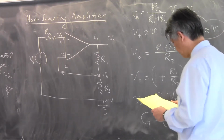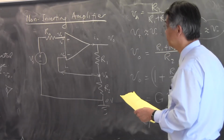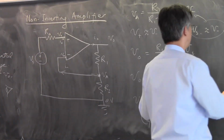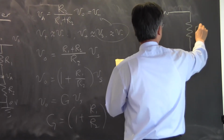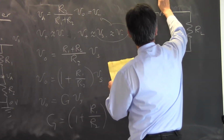And of course, as I said before, op-amps can be used for buffering. When you use the op-amp for buffering, it protects your source, source resistance and voltage source from external loading. It's been protected by this very clever electronic circuitry here. So that was being discussed in the textbook. Whereas if I were to not have the op-amp and connect the source directly to the load, you will have this kind of configuration over here, and then Vs. This is a no buffering case.